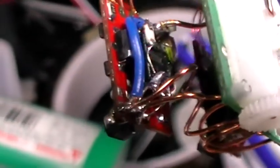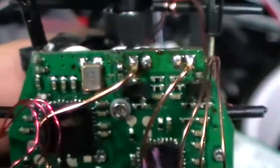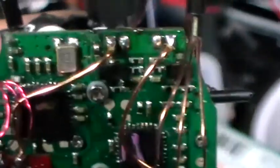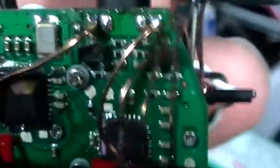On the back of this ESC I've got one of the Steve high speed converters wired in. Basically coming up from there I've got the two positive sides of the motor — the original wires going down to the Steve converters. The tail motor has a 2.2k resistor to ground, and the high speed one has a 470 ohm resistor to ground. That's on the original yellow wire that comes from the Steve converter.